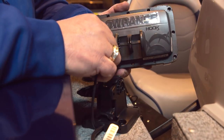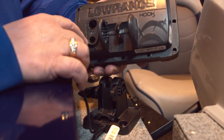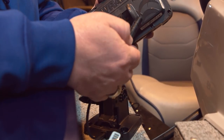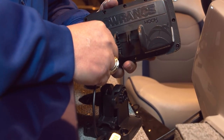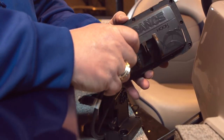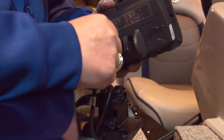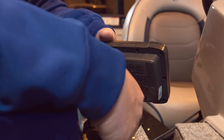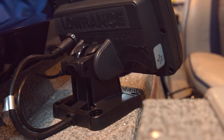Now we're going to put our connectors in the unit. There's a notch at the top of the connector and a notch on the inside, so you want to line those up — there's also a line on the very top of the plug showing the upside. We plug it in secure; you can see it goes down past the O-rings. It's a really tight, snug connection so it's not just going to fall out. We do the same with our triple shot transducer, get it plugged in all the way, then squeeze the ears, put it on the bracket, and flip the lever up to lock it into place.